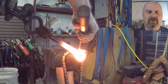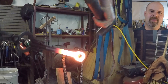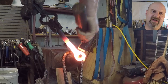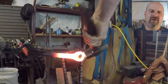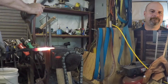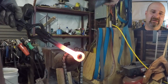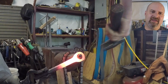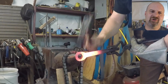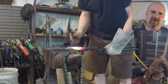I'm moving out to the horn of the anvil, and I try to go kind of evenly around — this will open the opener up the rest of the way to about one full inch when I'm done. Moving in a circle around helps keep it the right shape inside. I start out hitting flat on the material, just getting the outside width correct and stretching everything out, always dressing the face to keep the cracks out.